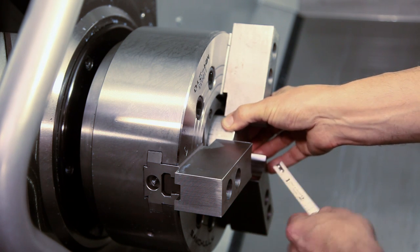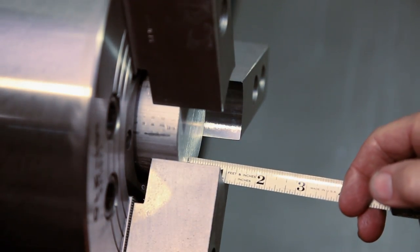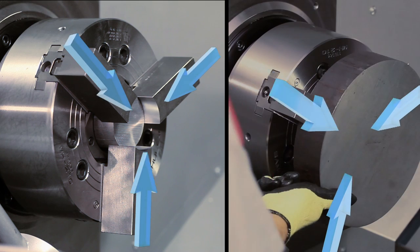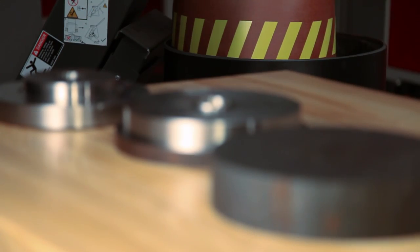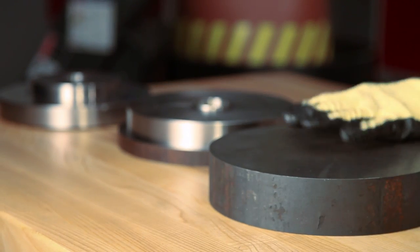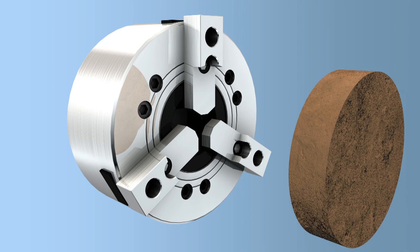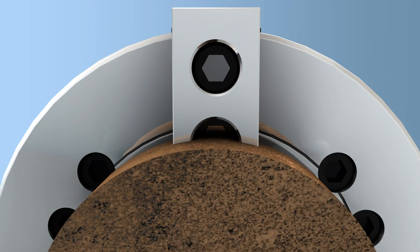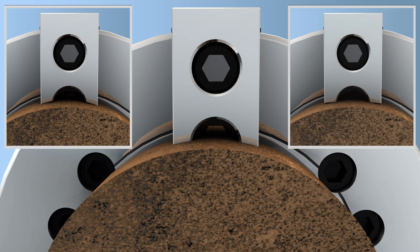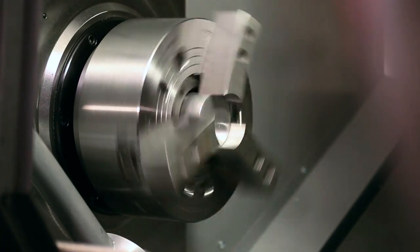With the bore for our plug complete, we clamp it at the center of the jaws, leaving adequate clearance for the cutting path. We apply the clamping force to the plug in the same direction and pressure that will be used on the workpiece, which in this case is 250 psi. Before cutting these jaws, Andrew notes that unlike our previous part, the finish on this material is very rough. Despite this variation, we will still cut the pocket to hold the raw stock at the nominal stock diameter, realizing that in some cases we will be holding at the six edges of the jaws and other times at the three centers. Now we will be making two-step jaws for this part, and with our program set to cut both pockets to the nominal size, we are ready to cut our jaws.